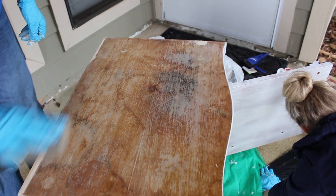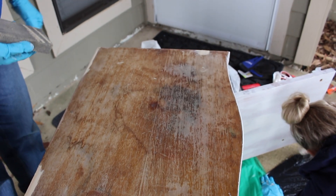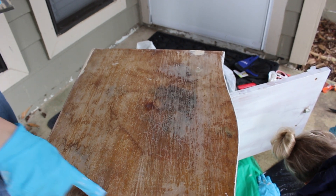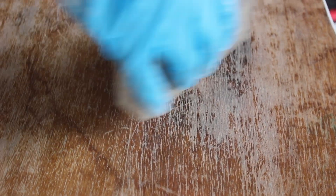As you can see, even after sanding, the top has a lot of damage. Some of it is water damage from things spilling on it — you can see a ring where something wet sat on it. There's also some darker areas that might be like a cigarette burn or some sort of heat source that really darkened the wood. It would be cool if the veneer would actually hold up to a shou sugi ban finish — that would be awesome — but it wouldn't.